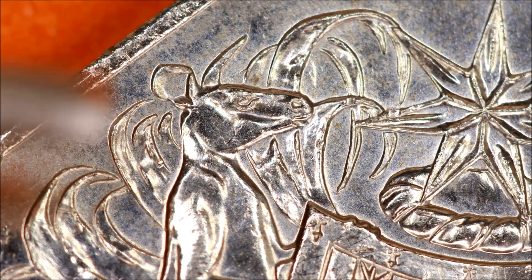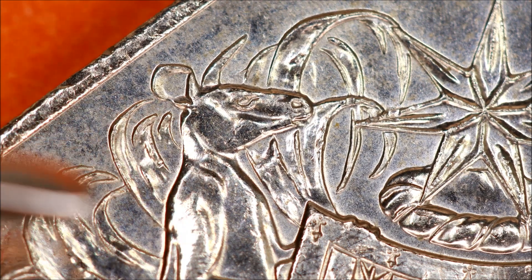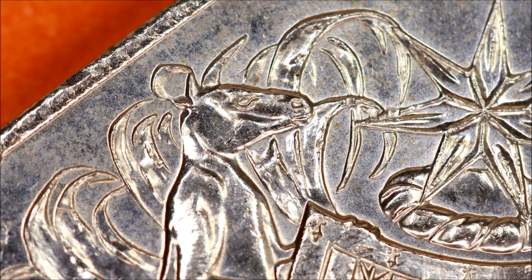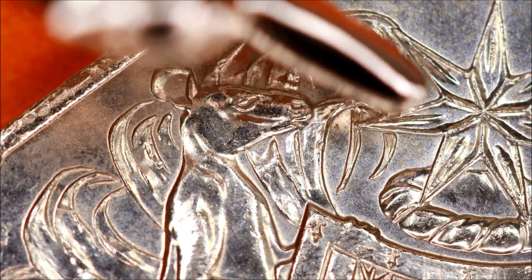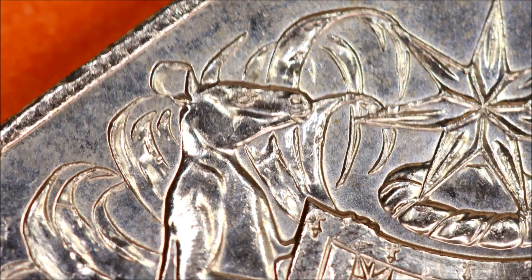Going down the flora down here, I can see it's all very thin compared to the normal properly minted coin. So it's got a lot of die fill. On this one, on the star point at nine o'clock, you can see there are a couple of structures — that's material on the anvil die that's been pressed into it. There's another spot down lower that also has some structure.